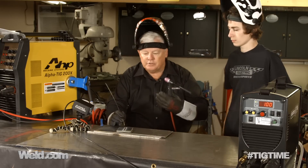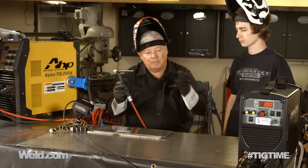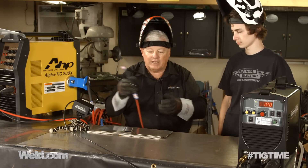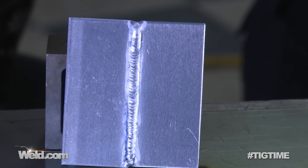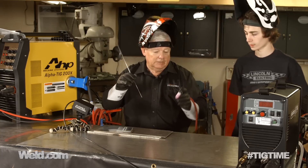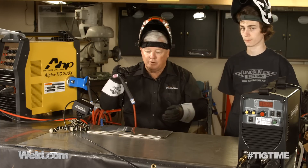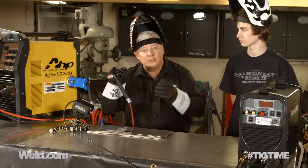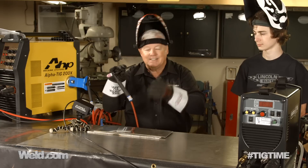Could you see the dabbing take place? There's no hurry — everybody has their own pace. The generator was running and I could see a little bit of fluttering, but I was setting my machine at about 100 hertz, and that's that fluttering sound you hear. You can adjust and set it to your liking. At 100 hertz you can see the edges wetted out very nicely — I didn't go concave. Go ahead and shut the machine off. We were using 6061 aluminum, 16-gauge material. My TIG torch is a number nine — didn't even challenge the torch. Good stability. We've got the Bulldog 5500 running out there and I'm glad it's out there instead of in here. It stabilized — you could field repair with this with no problem. The real challenge in all this is I had a 100-foot extension cord. Kudos to Lincoln Electric for having a machine that's that stable.